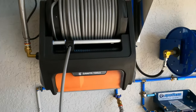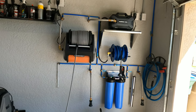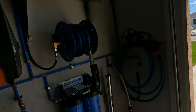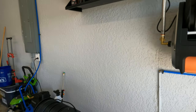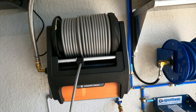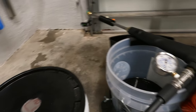That noise is strange — could it be that there's too much hose wound up while using it? I unwound a little bit to test. After retesting — still makes that weird whining sound when the trigger is released. Now we're going to test the gallons per minute.